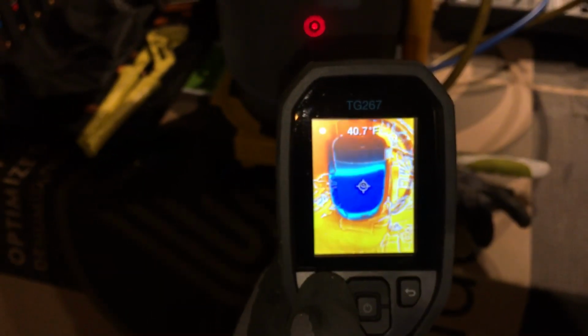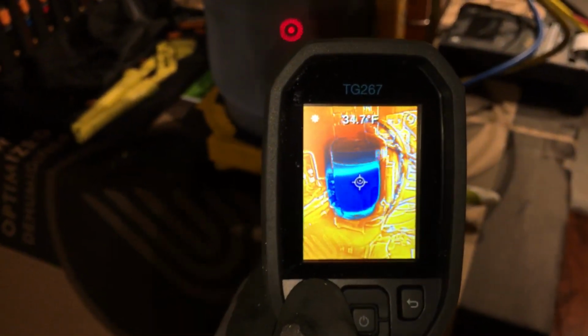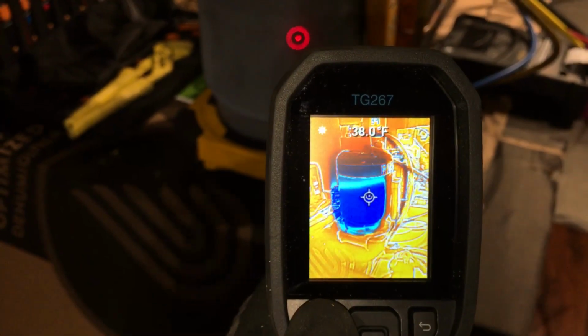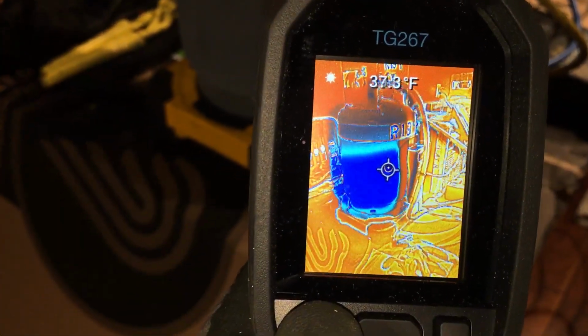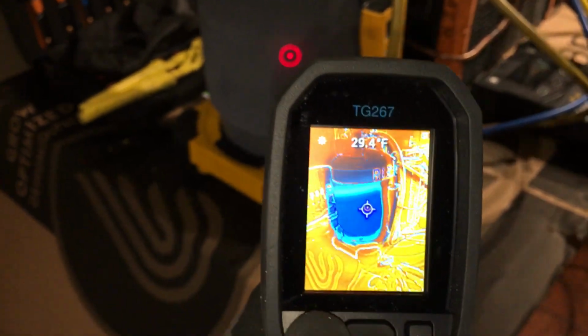If you ever watch Chris's videos on HVAC-R, he does this on the receivers when he's winterizing the charge for some of the walk-in units and stuff like that, to show you the level between the winter and summer charge. You do the exact same thing. And here you can physically see the level of refrigerant through the wall of the tank.